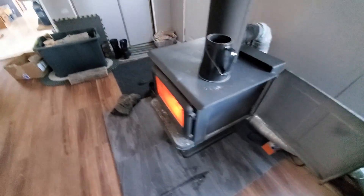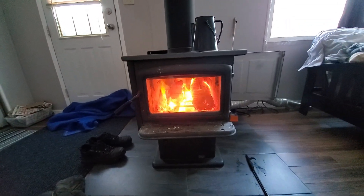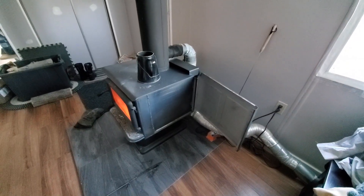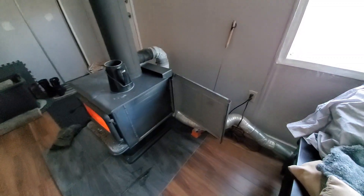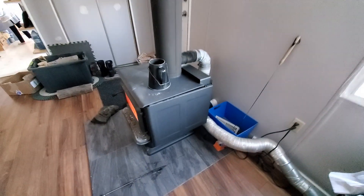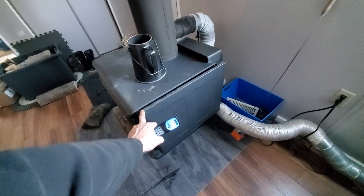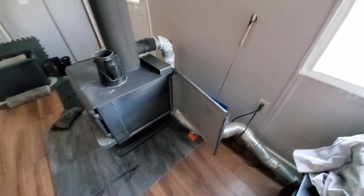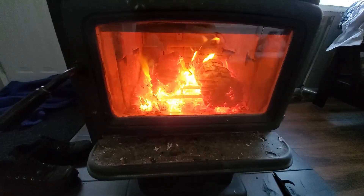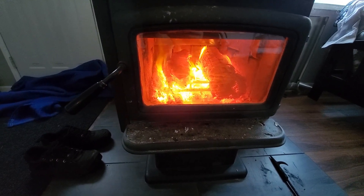Your wood stove has to heat up that intake air, and your wood will burn faster because you've got dense air — and I want a longer burn out of my wood. So that's why I did it that way. Having this flip-out door helps a lot too because it allows you to radiate the heat off the side of the wood stove rather than having the heat shield on here that they put on for safety reasons — it's a trailer-safe wood stove. I get a lot more heat this way, especially when it's this cold outside. That grate in there keeps the wood off the floor. It works good. I get lots of coals and not a lot of coal buildup.